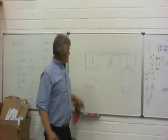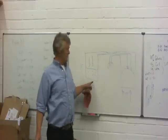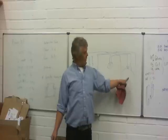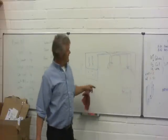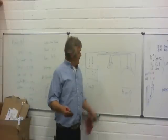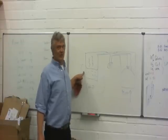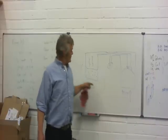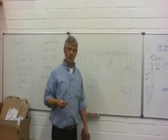If you think about this — when you boil water, particularly salty water, what you get is pure water vapour given off and the salt is left behind. So what you get in the other can is desalinated water. If you then put that in the sun to regenerate and collect that water you're getting back, you're going to get pure water. So one of these things could be looked at as a method of desalinating water. To pump a vacuum is a lot easier than it is to heat water to 100 degrees atmospherically. In energy terms it's much cheaper to pump a vacuum down and let the ambient temperature do it — so there's an awful big advantage there as a potential desalination system.